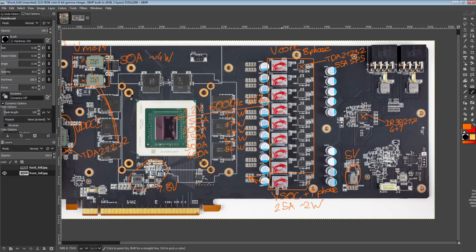And the only real concerns are if there's massive differences in terms of voltage controllers or memory chips. Sometimes you'll have a BIOS which doesn't support the memory on a certain card, and then you flash that and, well, you're screwed. So yeah, it would be nice to have the dual BIOS because it does make recovering from a bad BIOS flash much more convenient. But at the same time, it's not really that risky.